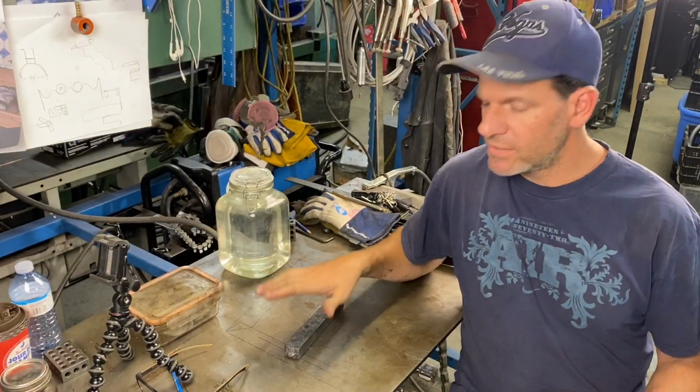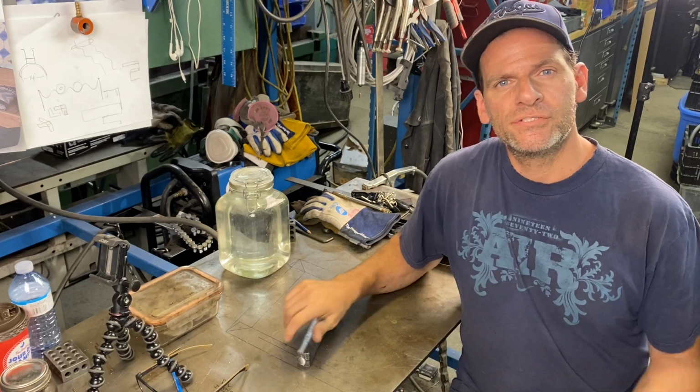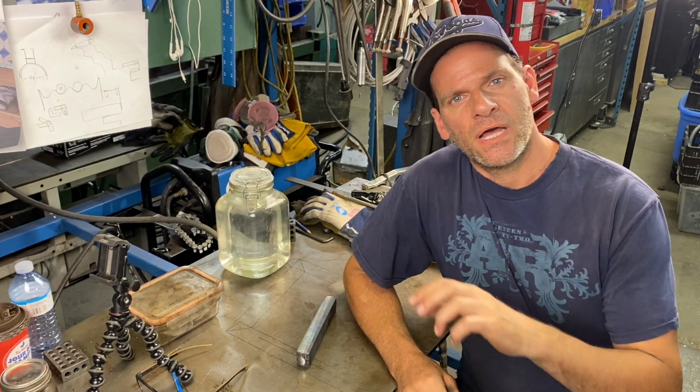So now I have my billet all machined. What I'm going to do now is go in my office and use my CAD software, and we're going to draw up the billet in the CAD program, and then we're going to use probably a 3/16 flat bottom tool. I'll get into the actual programming on another video, but for now, we're just going to show you a little bit about the program itself, and then we'll run the machine and make those cutouts.